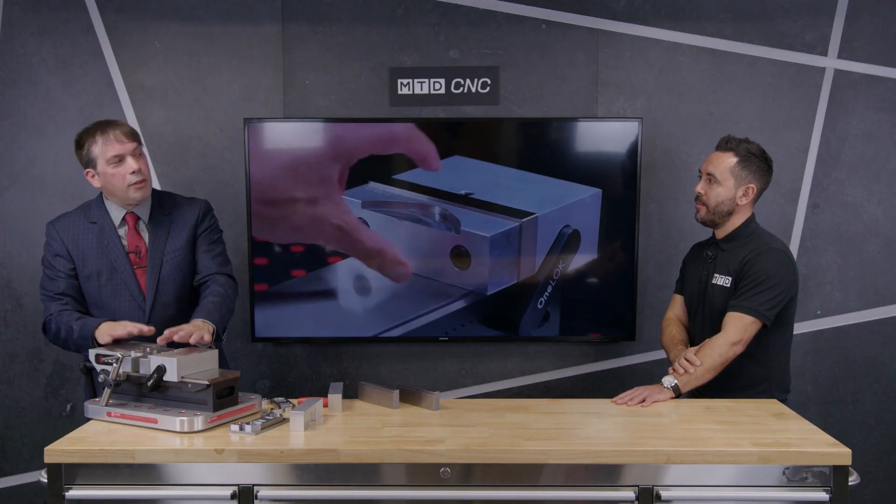With that very high quality surface contact, it eliminates vibration. How important is this? In modern machines with modern tools, modern feed rates and modern spindle speeds, it's very, very important. That's one of the key things about the OneLock — it's designed for modern machining. Even though you're doing a one-off or working in a tool room, you can still have the benefit of modern technology.